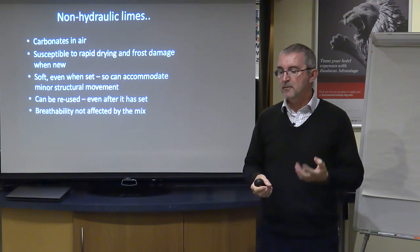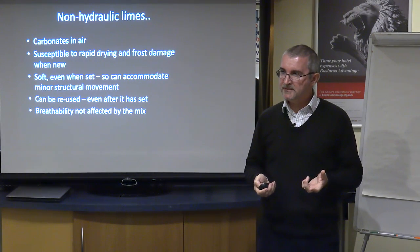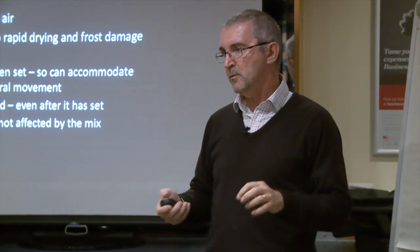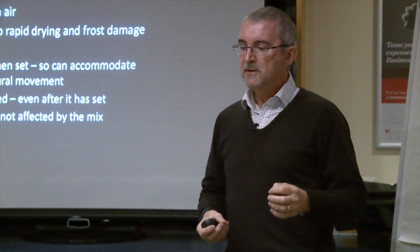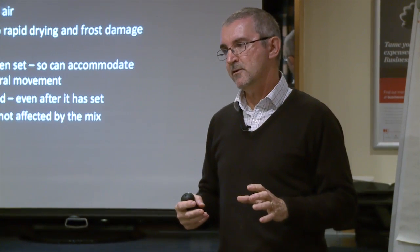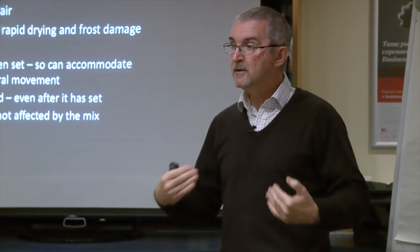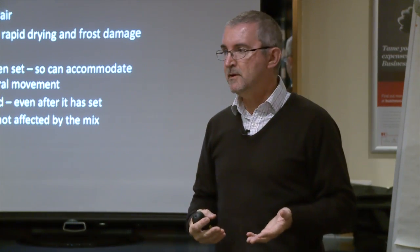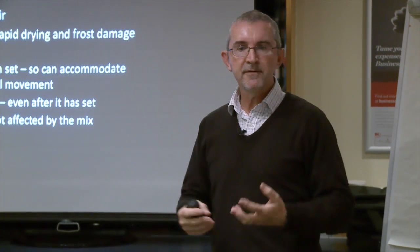Outside of those months, you must be aware that the mortar itself will be at risk, and therefore if the contractor is working in an environment where it's particularly hot or particularly cold, that mortar could be permanently damaged. So it's not to say that you can't work outdoors, it's just that you've got to take precautions in those winter periods. So by using a fully sheeted scaffold, maybe even having heating on the outside of the building to heat the scaffold, to keep the air temperature up overnight, putting carpet over your wall overnight, whatever you might need to do.